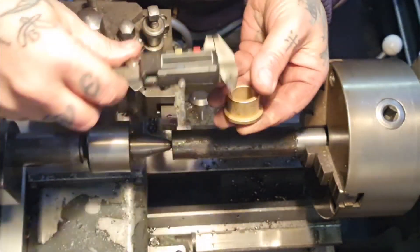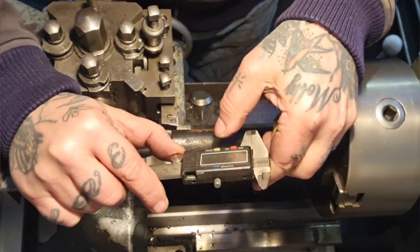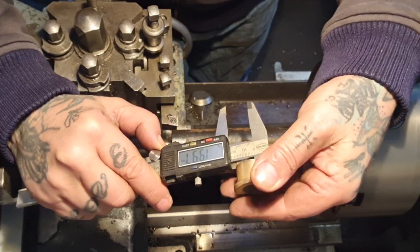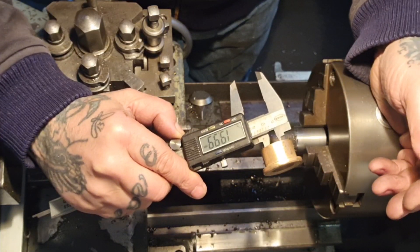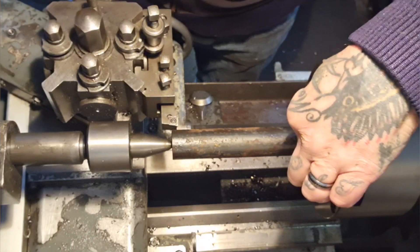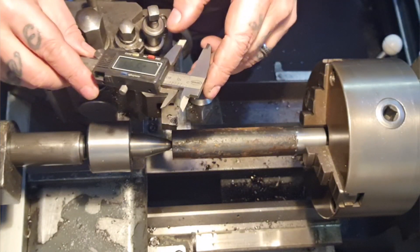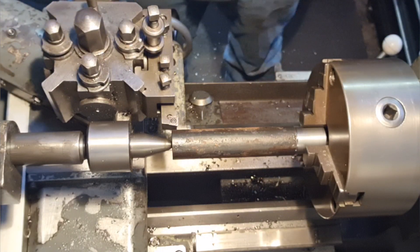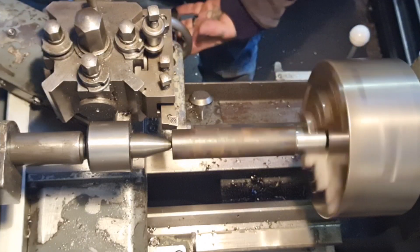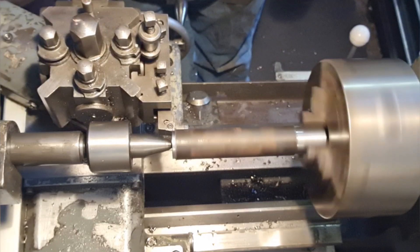Have a measure - zero. It's telling me it's 20mm so we need to go to 19.9 or 19.8. This needs to be parallel for the entire length: that bit goes over the spacer, then we've got a bush with a sleeve, another bush, then it goes inside the foot peg. I've had the lathe running a few minutes to get the oil in and the bearings warmed up a little bit. I'm going to take a starter cut and then we'll set the size on the DRO.